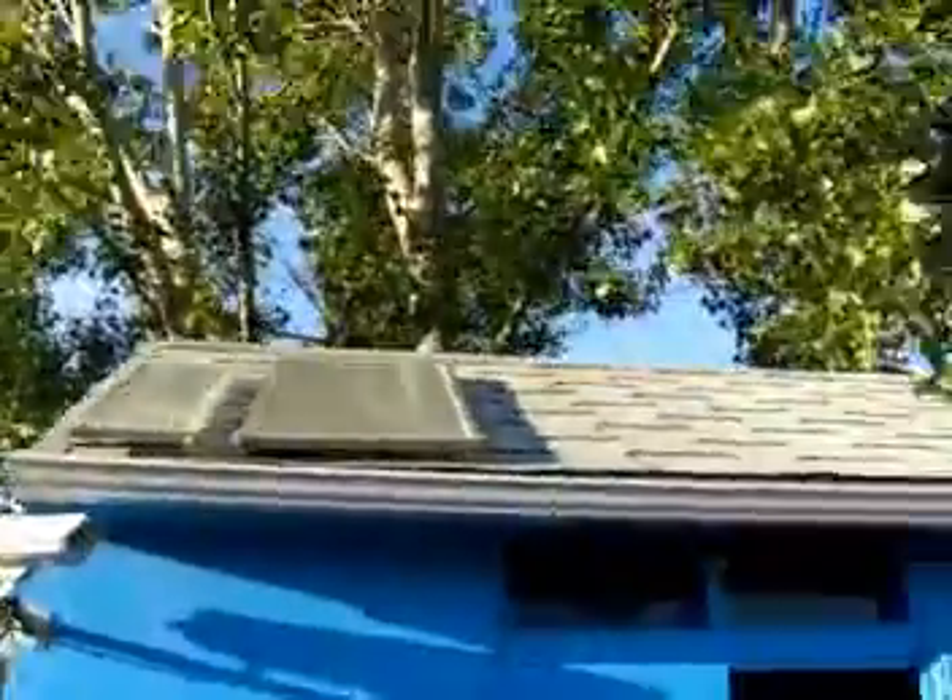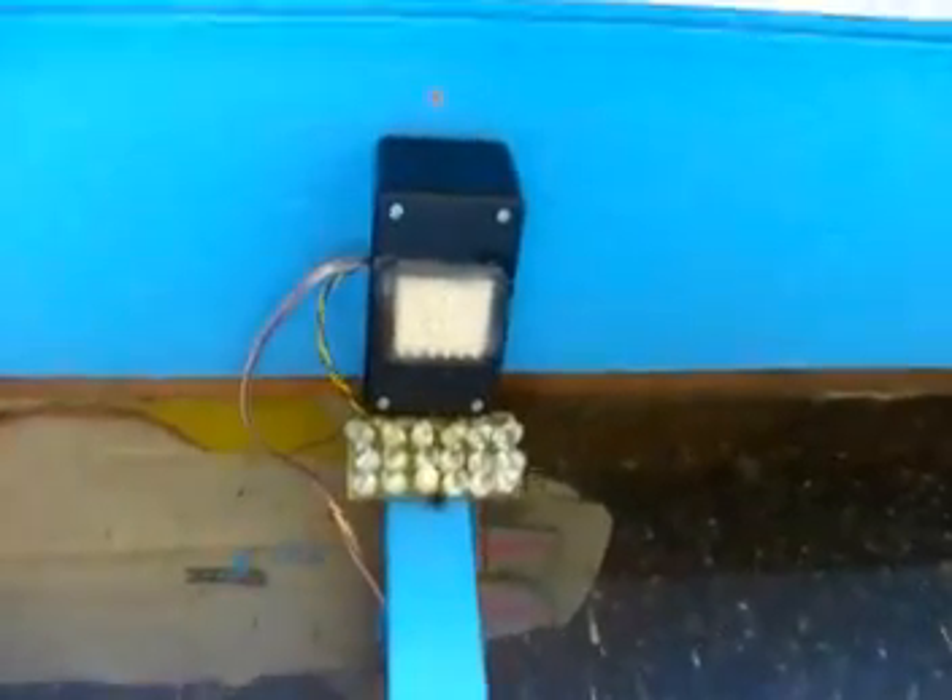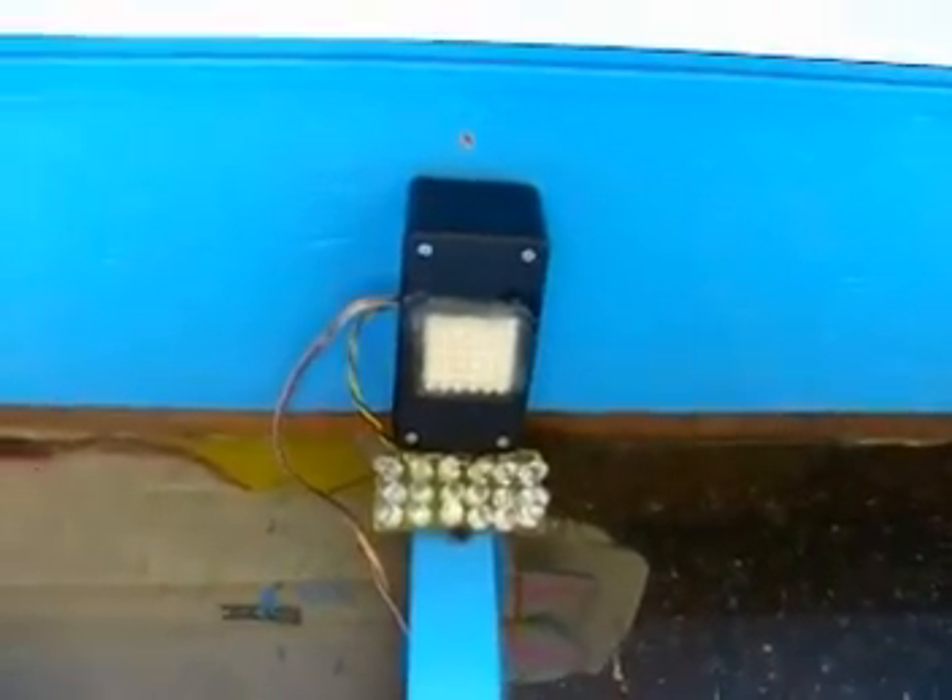We have them mounted on the shed. They run a little night light with a bunch of super bright LEDs bought off eBay. Inside we have a little 12-volt charge controller, a 10-amp unit, which charges up a battery. It works great — I checked a little while ago and it's at 14.4 volts. It charges up during the day and drains during the night.